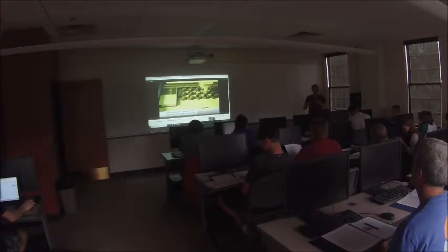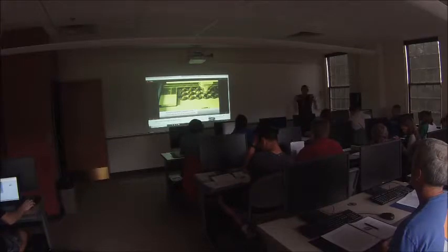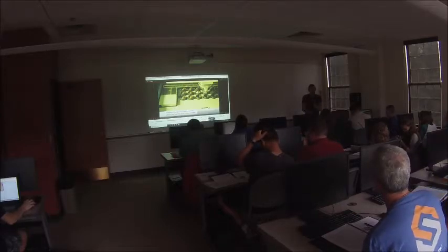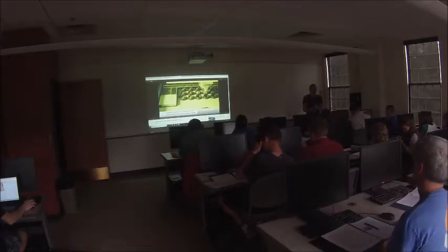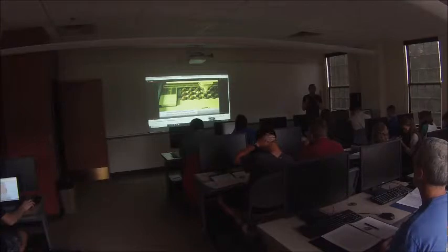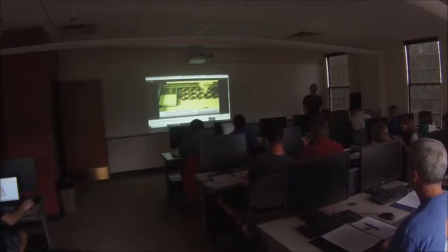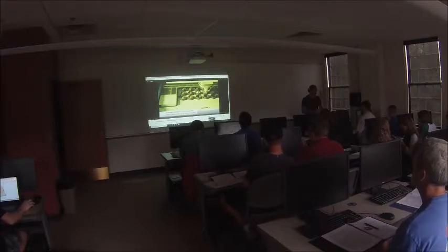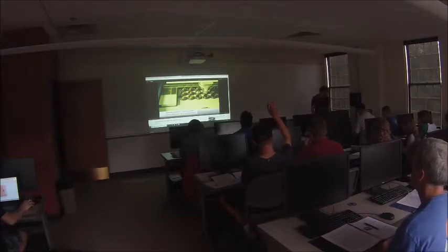As it cuts some thicker stuff, the water jet kind of diverges, right? It flares out as it goes through the material. So your cut, what's called the kerf, which is basically the material that's removed by the cut, right? So the kerf is fairly wide, right? It removes quite a bit of material, and it gets wider as it goes through the material, which can be a problem sometimes. Lasers and plasmas do that a little bit. The water jet's kind of notorious for it. Lasers don't really do it as much, but.